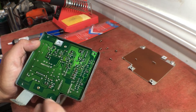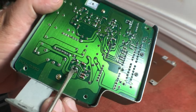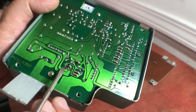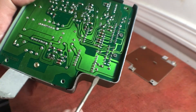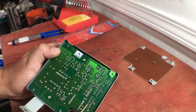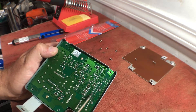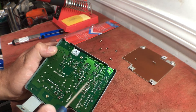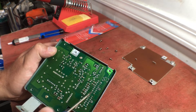These are the power lines going to the rest of the components. It does look a little brown right there on these two points. I might try and clean that up just a little bit, but you've got to be real careful because they're so close together. What we're going to do is wash this off with some acetone to get any coating off and then get a clean hit for re-melting these solder points.